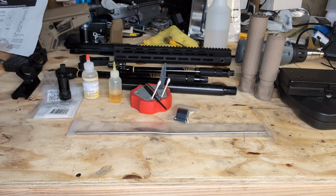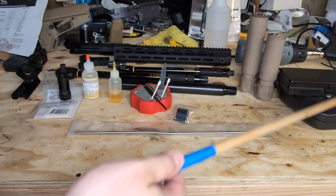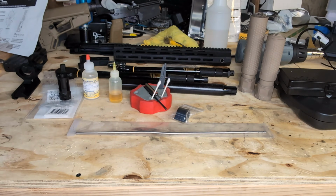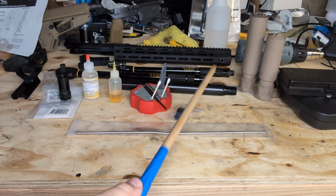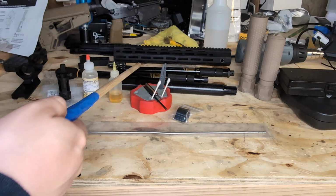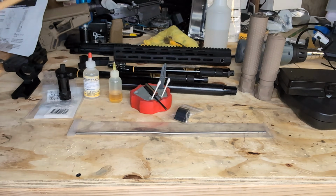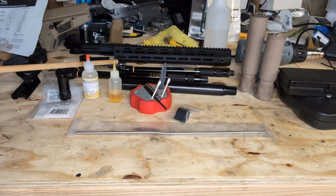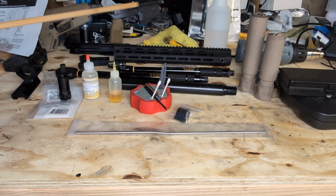And that'll be it. And then random wrenches of different sizes and a torque wrench for the set screws and the gas block. And like I mentioned, a reaction rod and then appropriate torque wrenches, 1/2-inch drive for the URX4 wrench, and then a 7/8 crowfoot for the flash hider. This one just happened to fit on a 1/4 inch.